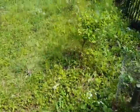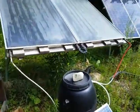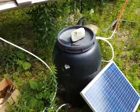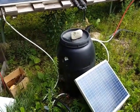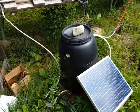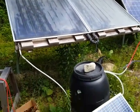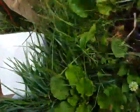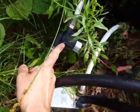The sun is probably beating down on the irrigation tube all the way over to where I have my setup. Here's the hot water barrel setup that I use for my shower — you can watch that video. Basically there's just a circulator pump running on solar that's heating a 50-gallon barrel of water. But after about two or three hours in really bright sun, the barrel gets about as hot as it's going to get, probably between 120 and 140 degrees Fahrenheit. So you're not collecting a lot of energy from the panels once the water gets that hot. I said to myself I should be using this energy for something else, so what I'm doing is running my pool water through this heat exchanger. Come out of the barrel, go into the heat exchanger — here's my circulator pump that's going to my solar panels.